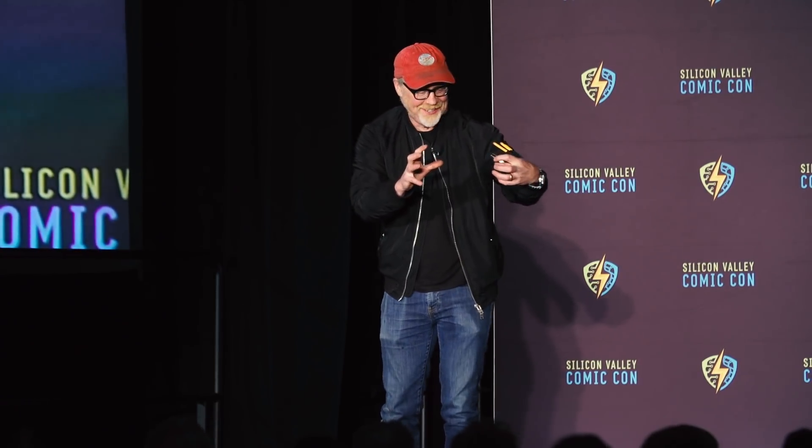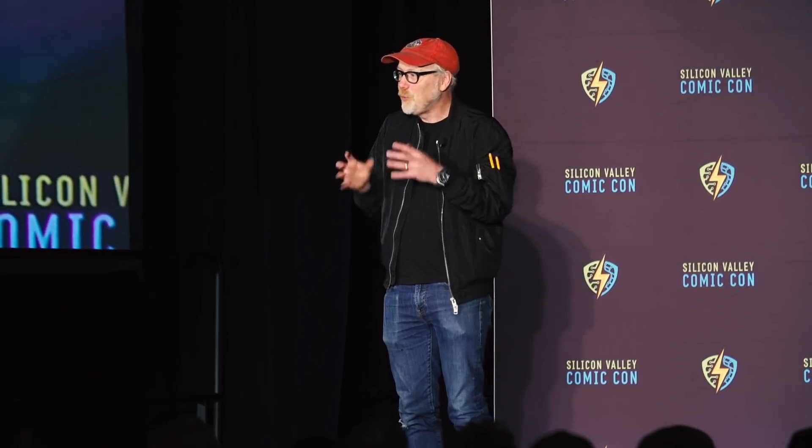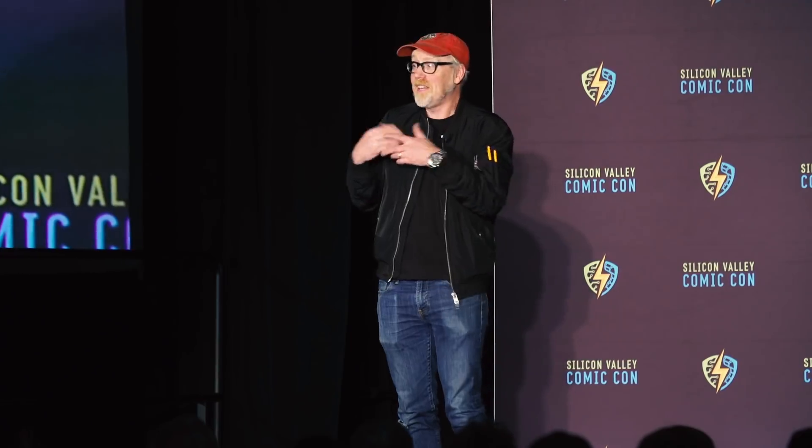So after taking a nap and cleaning my shop, I chucked this 14-pound hunk of cast iron into my lathe, which is one of the scariest things I've ever done. I started it spinning, and I was like, okay, it's not flying across the room, and I approached it carefully. I slowly made a couple of reference surfaces on it — that means I machined enough of it so that when I took it off, I would have a perfectly round reference point that I could repeat and then handle the rest of the machining. I haven't done anything like that at all. It was an hour and a half of really careful, precise work of a kind that I had never tried. I was thrilled the whole time, even as hot chunks of cast iron were flying into my face and burning me.